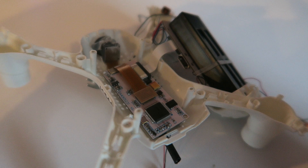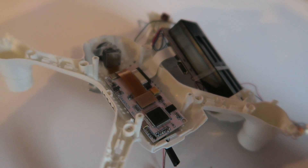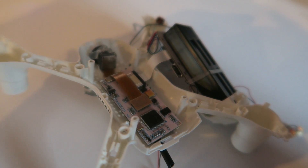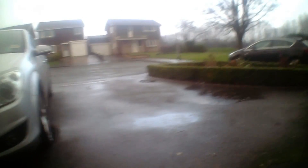It was so tricky to find a way of focusing this lens. I used a tiny elastic band to attach the battery to the flight controller. I left the camera in its housing with the camera and ribbon lifted up above the aircraft so I could twist the lens to focus it. I turned on the FPV transmitter and turned the quad on and used the FPV screen to see if I was in focus. It's a disaster — the focusing issue with this quad is a limitation of the lens. The sweet spot of this lens does not focus to infinity.